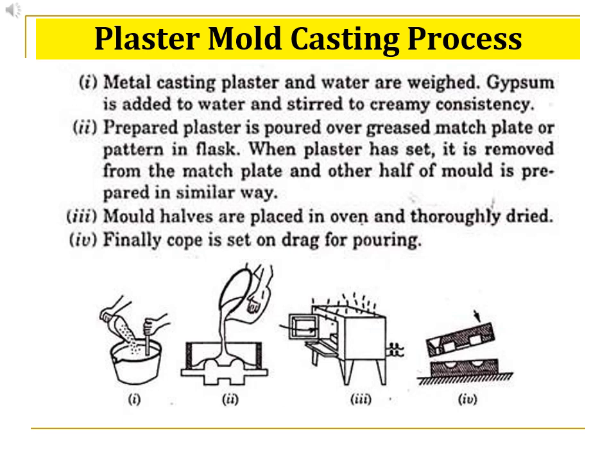This slurry is poured over a carefully made match plate type pattern, usually of metal. The mold is vibrated slightly to ensure the plaster fills all small cavities. The initial setting takes place at room temperature a few minutes after pouring the slurry, and then the pattern can be removed. Sometimes, the initial setting time is decreased by heating or by adding a small quantity of natural gypsum calcium. Copes and drags are made simultaneously on separate lines and dried in ovens at 200 to 425 degrees Celsius, until all free and combined moisture is removed. Normally 20 hours is the time for drying.